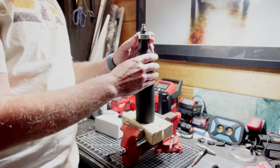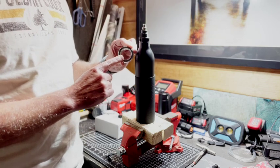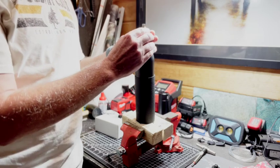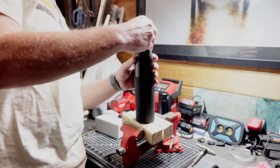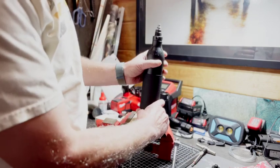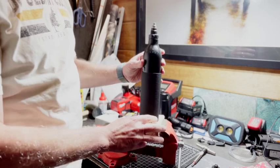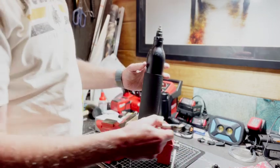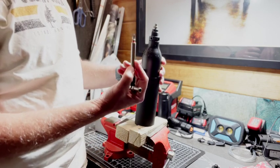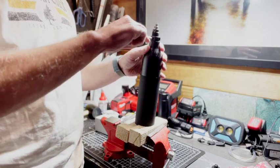This is a one-and-a-quarter-inch internal diameter shaft collar — I'll put the link below. When I try to put it around the collar of this valve, it doesn't fit exactly because there's a little piece that sticks out right here. I don't even know what that does, but I'm going to remove it. I've got a bit that fits it just right, so I'll take that out, otherwise the shaft collar will not slide like it needs to.